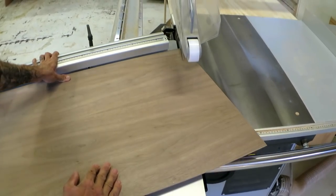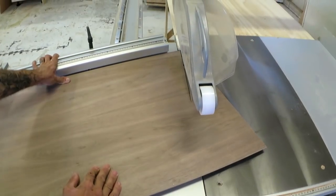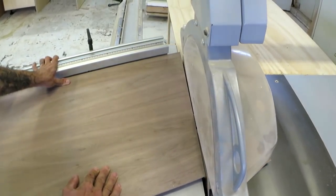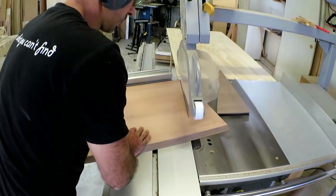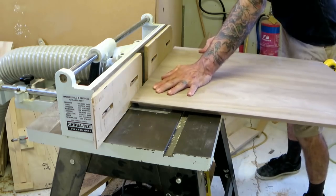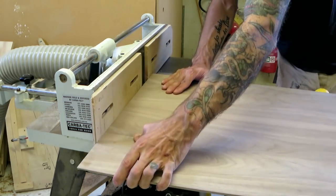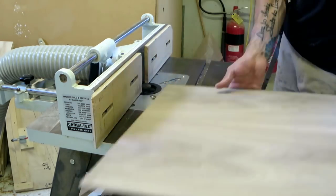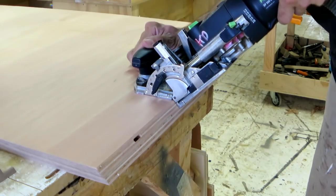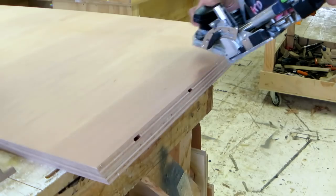So this is really the start of the first mistake on this job. That triangle should have been quite a bit bigger, and while I was planning to use that offcut for the lid and have a nice grain matched side, it just wasn't going to be big enough, but I don't know that yet. So I added some rebates for the bottom panel to sit into, and then I could domino the corners of the main carcass.